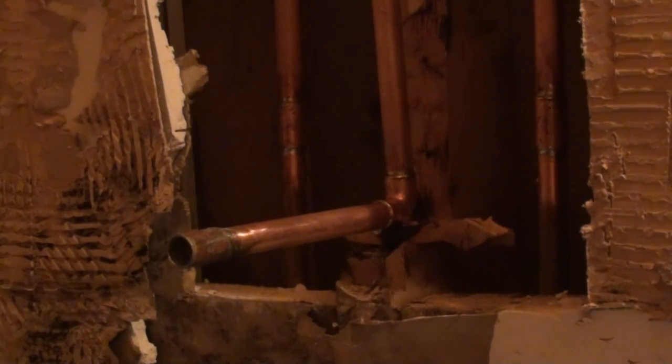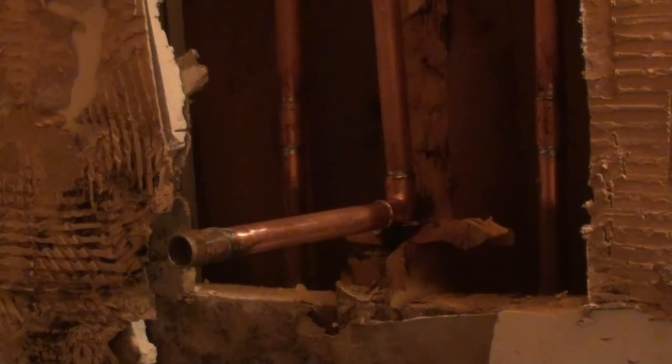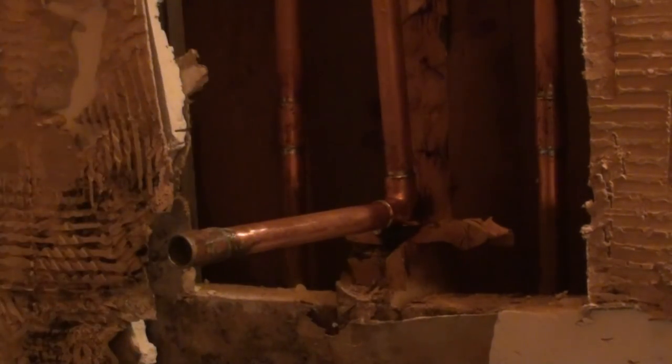Again, I always try to go with Moen. They seem to be the better faucet. Their parts are expensive when it does come time to get them. However, they warranty them for life. All you got to do is call 1-800-BUY-MOEN and they'll send you a new cartridge for free. Those cartridges and these Positemp valves are about $50. You can get an off-brand for about $38. I don't normally suggest doing that, but it will work.